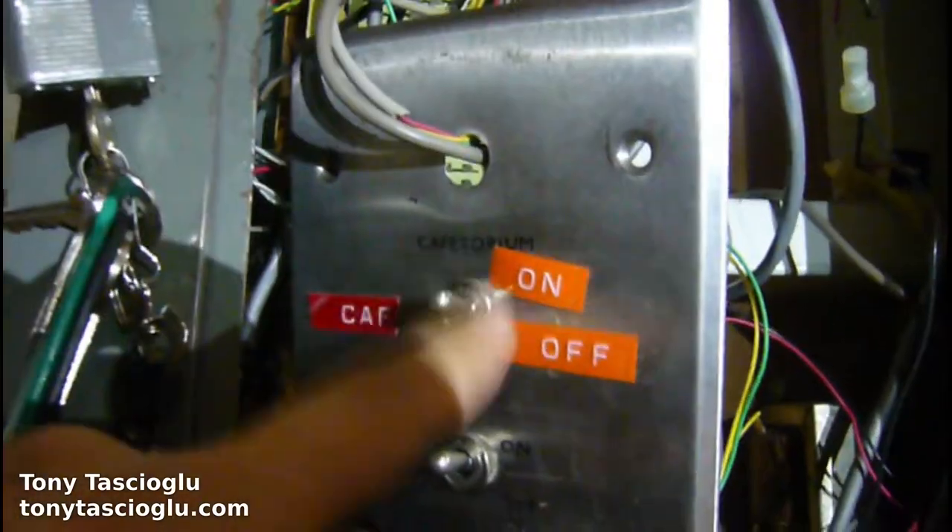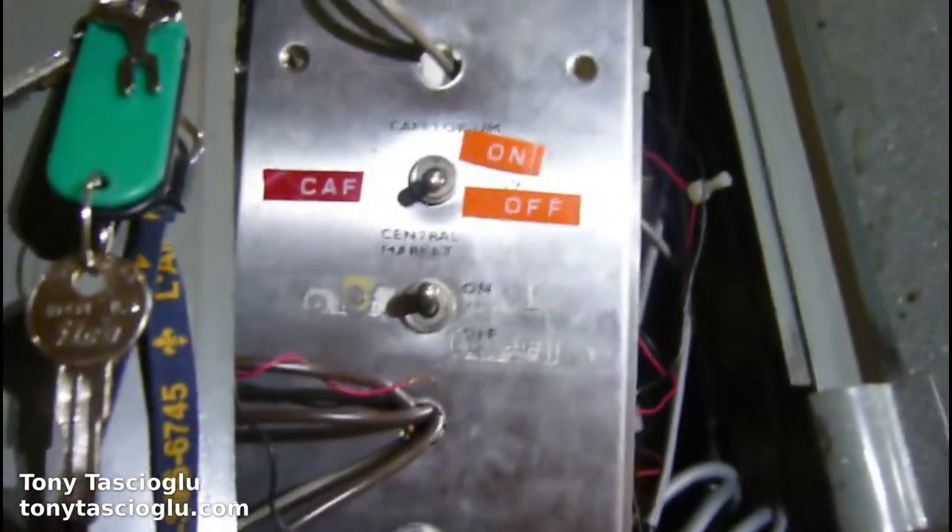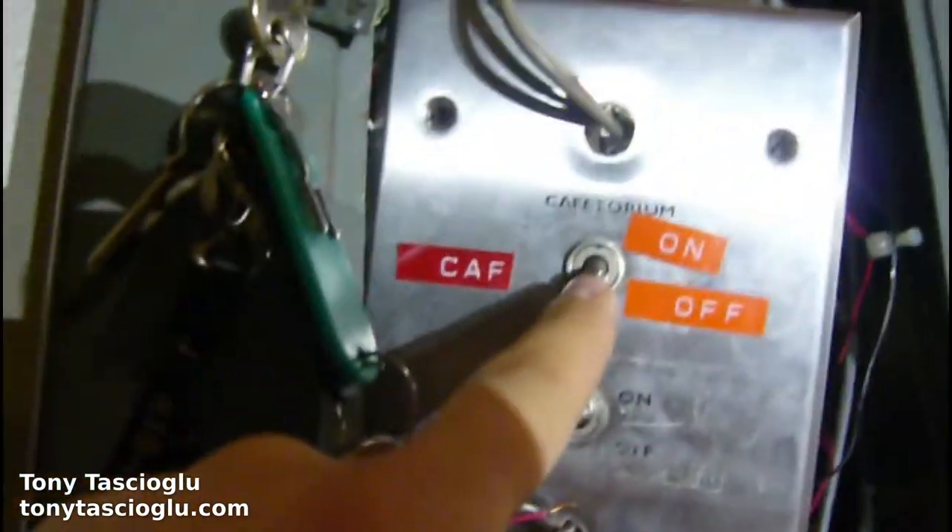Here is a little switchboard — you can see six wires attached to the back of each switch. There are three switches: the first one says 'Cafetorium,' the second says 'Central Market,' and the third says just 'Market.' The top one is a selector for whether the amplifier output should be connected to the cafeteria speakers or whether those speakers connect as a classroom to the office. During exam time it has to be off so speakers connect to the office; for events and assemblies we switch it on to connect the speakers to the amplifier so we can use the microphone inputs.